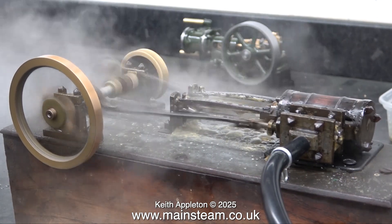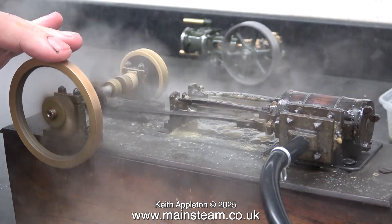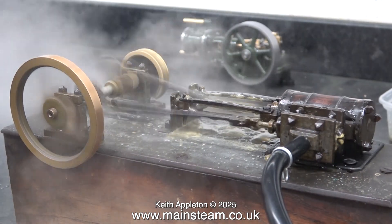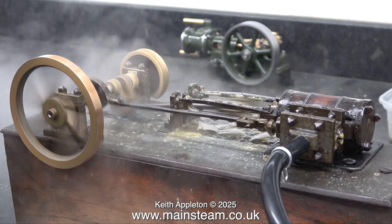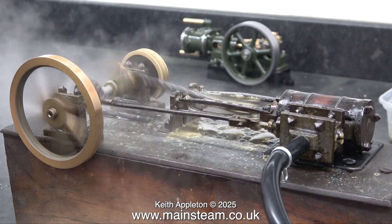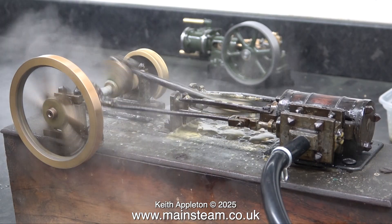You can see the noise of the steam declined. I'm purposely running this engine at a very high speed to make sure that it doesn't break — and it doesn't, it works well. That is except for the piston rod gland which is blowing very badly as you can see.